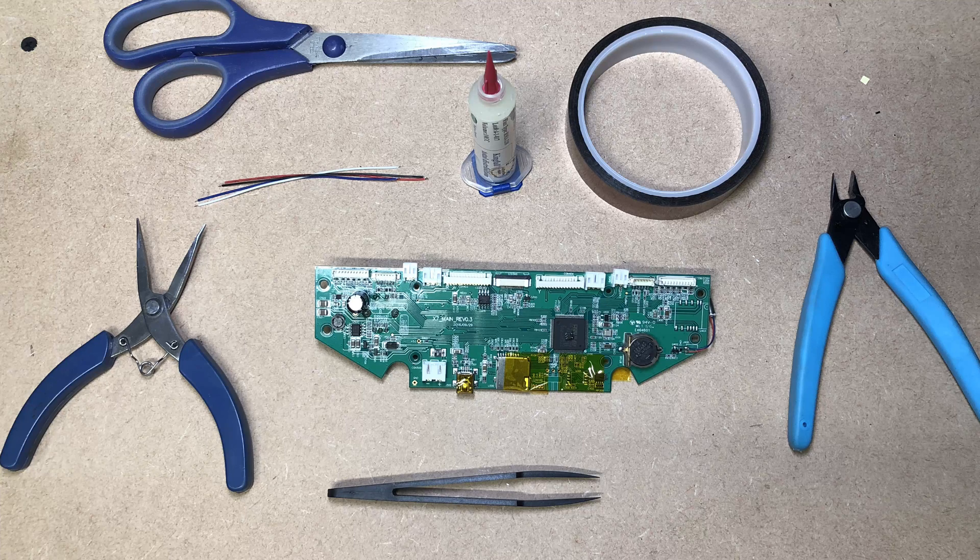You're also going to need to take the main board out of your radio. There's just four screws on the back, eight screws on the main board itself, and all the connectors. The middle connector — the ribbon one — is not a clip up, it's a push away. So you push on either side of that black clip and it will release that ribbon cable.